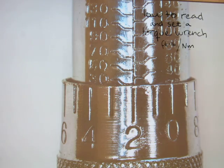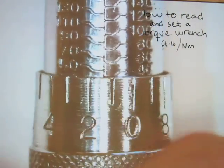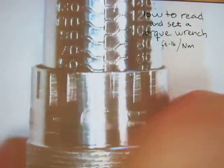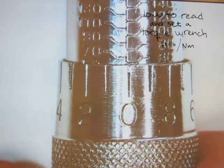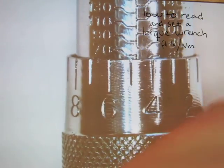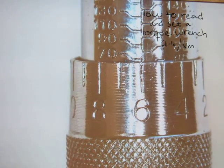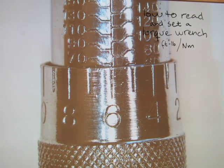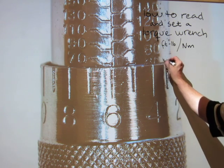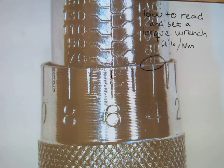Let's try another setting: 66 foot pounds. That's 60 foot pounds there, and to advance six more, rotate the handle until the 6 lines up with the vertical line on the main scale. This now reads as 66 foot pounds. The 60 is still halfway visible on the main scale - that's the tens amount - and the ones amount is the 6 on the handle lining up with the vertical line.